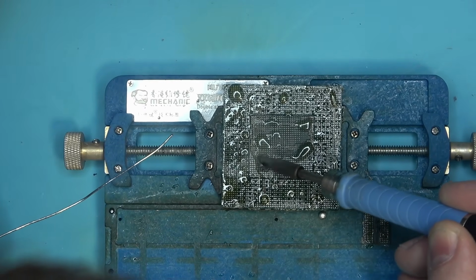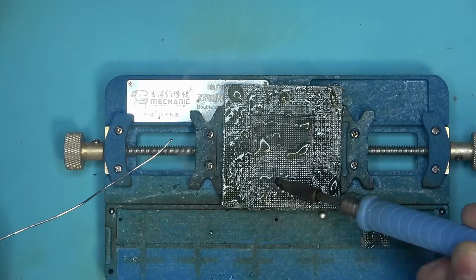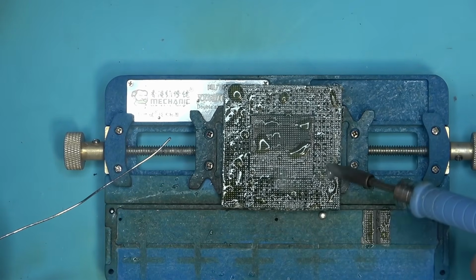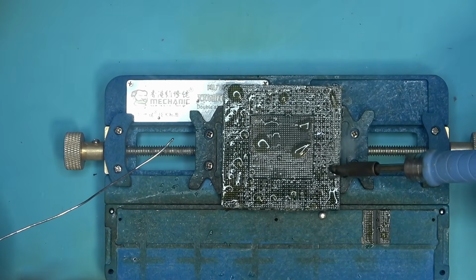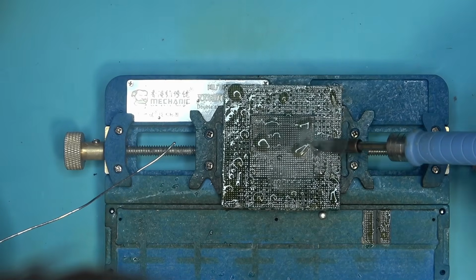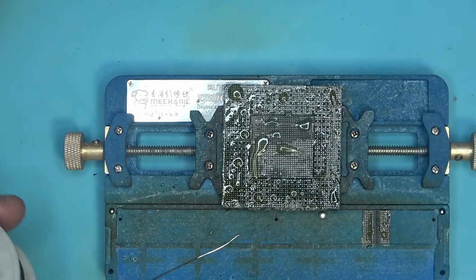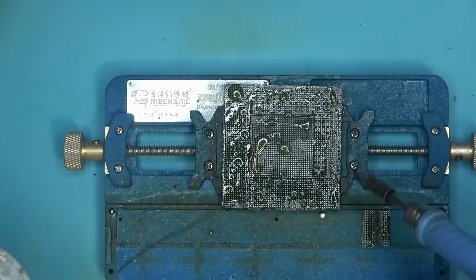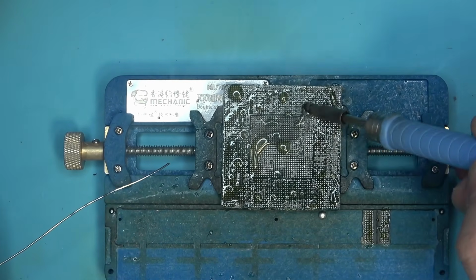and it will minimize the scuffing damage of the chip, which is very noticeable, especially on the memory chips. That could cause issues, but not so much on the core. At least not on the NVIDIA cores. On the AMDs, yeah, their cores are junk. You can scrape their core very easily and get it damaged, and I've even seen pads on the core get ripped off on 7900 chips.